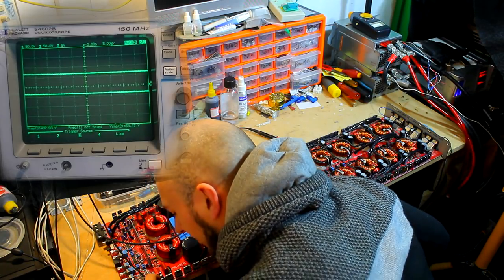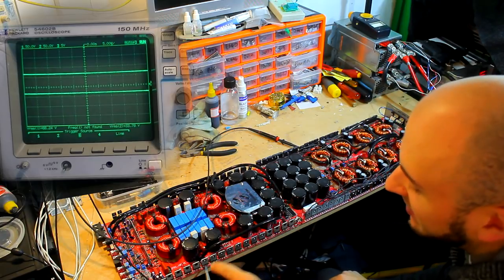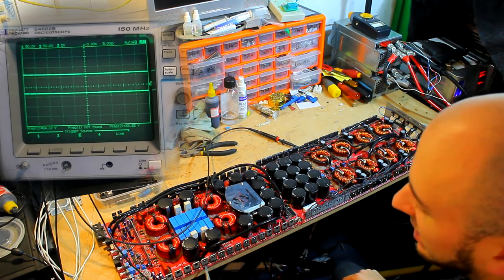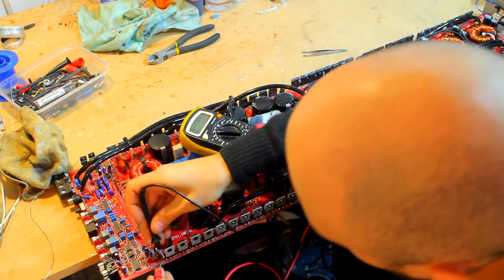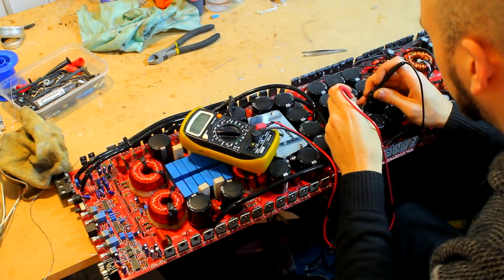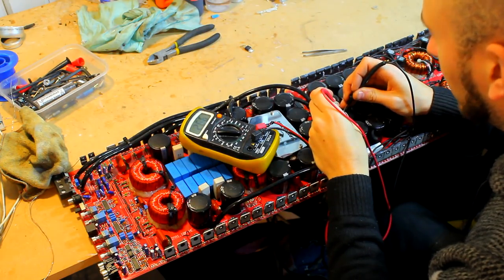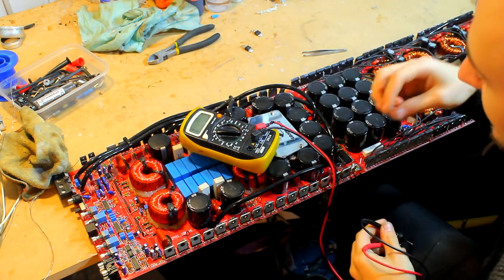It seems to be this voltage regulator that smells bad. So maybe they blew and took out the trace. Yeah, that stinks. So, okay, let's go ahead and change those voltage regulators before anything else then. So, we've taken the two 12-volt regulators out, and there is not a short on the board, so it seems that one of these has died. That would be correct. So this one has died, causing the short circuit, causing the smelly heat on the board. This one has also died. So we've got two dead 12-volt regulators there that we need to replace.